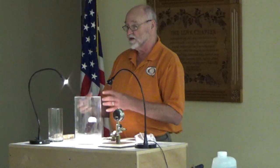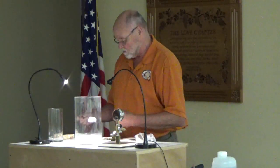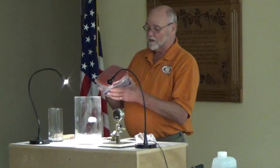After you get the wood hot, it's cooked and it's ready to go and dry, take it out of the oven. Don't set it on the counter till it's cool enough to put in the tank with the resin. If you do that, what's going to happen? It's going to suck up that moisture in the air. I take and put them in a Rubbermaid container inside a Ziploc bag. It keeps the moisture out, pretty much. You may get a little bit in there from the air in the bag and air in the Tupperware thing, but not enough to do anything.